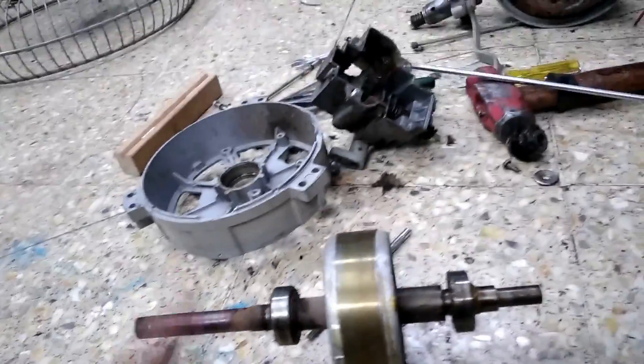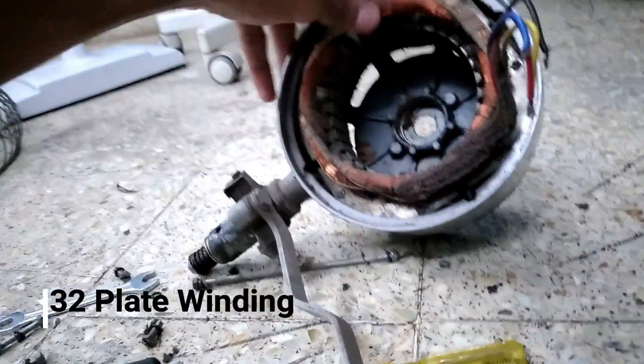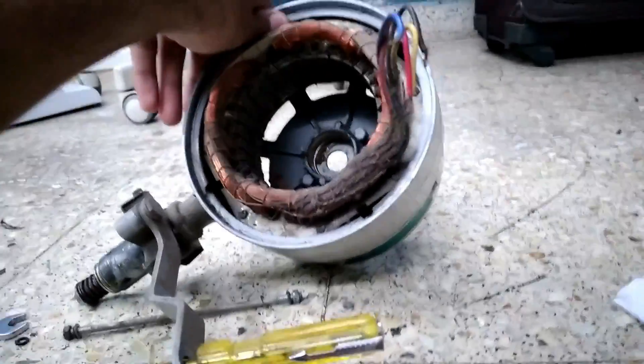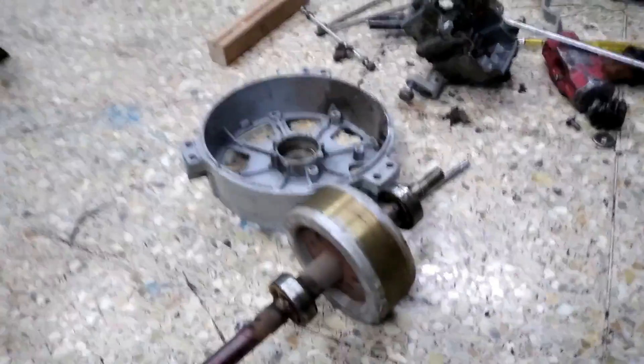The fan is finally torn down. This is the rotor assembly. This is a 6202 or 6203 bearing. As it is shaft-fitted, I will take it to my winding guy and ask him to replace it using bearing pullers. To remove this shaft, first you need to unscrew this and remove the gear, and then it comes out from the back body. This is the winding — I'm not sure how many plates this is, but it's a very powerful winding. I'll ask a friend and put the pole count in the description. So now let's get the bearings changed.